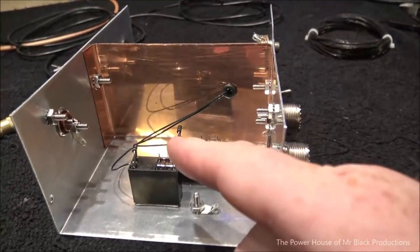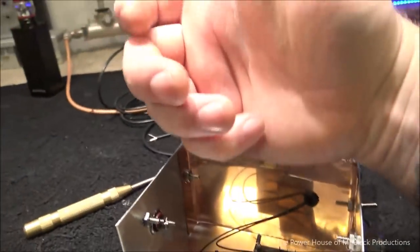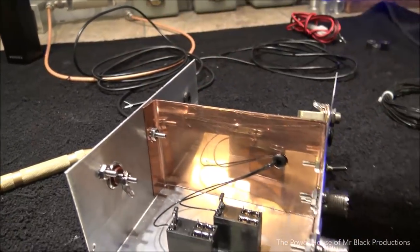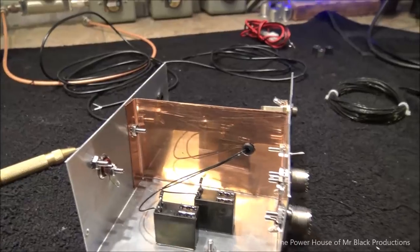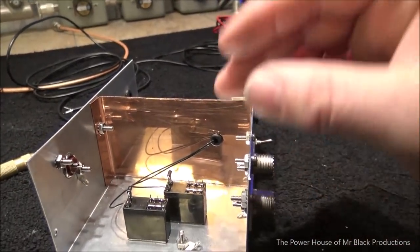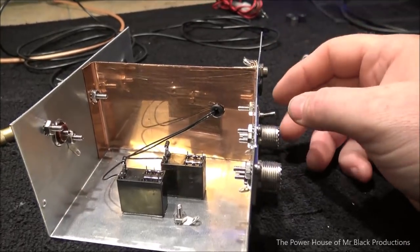If you don't add little snub diodes when you unkey or key up, there's going to be a pop in your receive. It's going to be really present in the receive of the radio. When you unkey, it's going to pop. You're going to see a little spike of signal in the receiver.